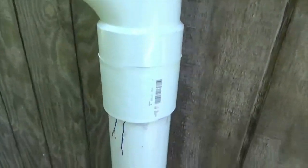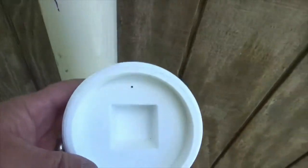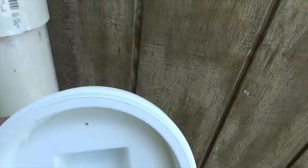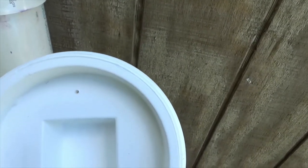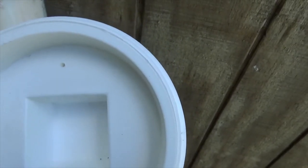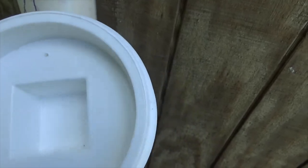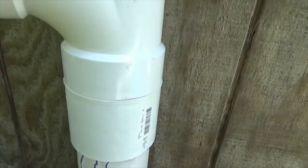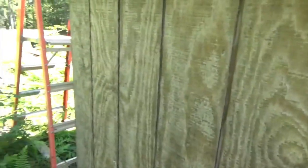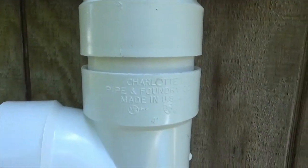We've got our coupler on there and our clean-out piece. I got this cap and just drilled a hole in it so the water will weep out. I didn't put it in the bottom — I figured that would get more sediment and clog up. It's a 5/64 drill bit so it'll just drain out slowly. Then it'll fill up the column — this 4-inch — and then run over to here and into this section which I haven't glued and I'm not planning on gluing.